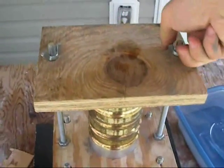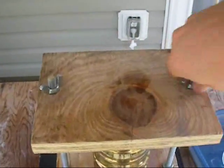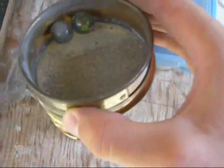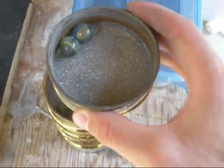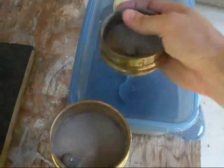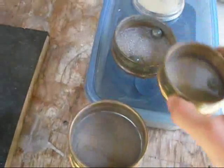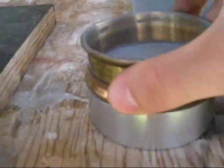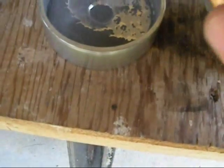I'm going to cut it off and let's see if anything made it through to the bottom. We can pull this out and open it up. As you can see, most of the really coarse stuff is still left at the top, which is 150 microns. As we move down it's finer and finer. My smallest mesh size is 53 microns, so everything in the bottom sieve is above 53 microns, and everything that falls through is 53 microns or smaller.